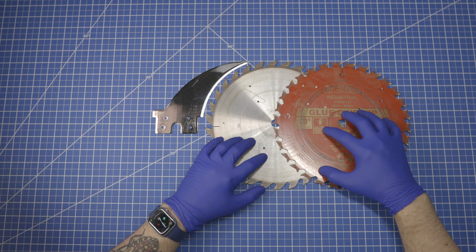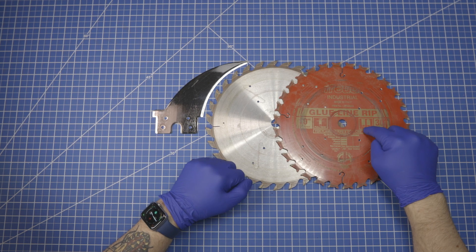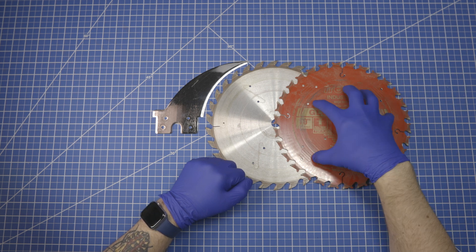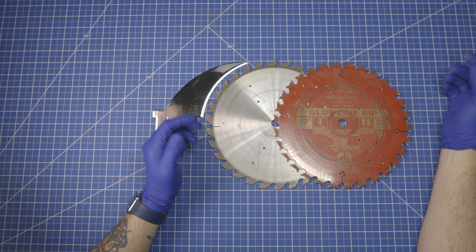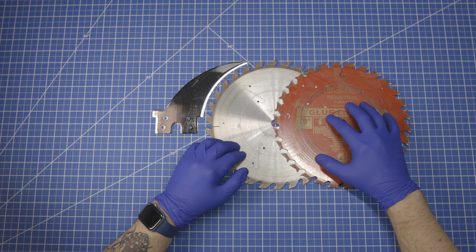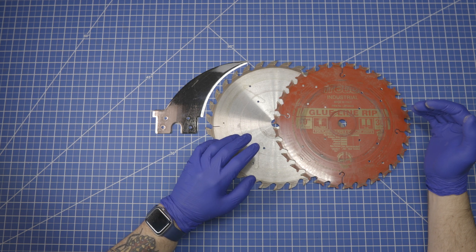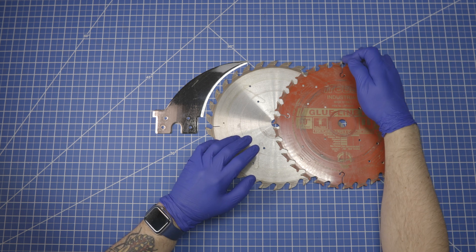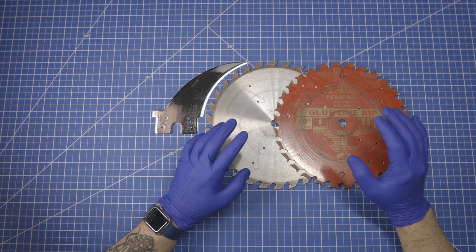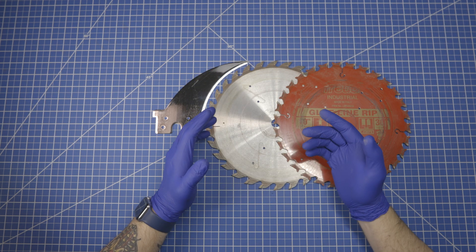These two blades may look the same, and in fact they're both labeled 10 inches. However, this is a 250mm blade. This label is a lie — this is just a screen print for the American market. And there is a bit of a problem using this table saw blade on a 10-inch table saw. When doing a non-throughcut — that is, a cut where the blade doesn't extend all the way through the material — as you're passing the wood over, you will impact the riving knife, which is a very dangerous situation.